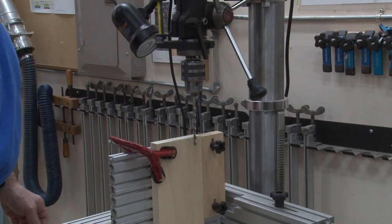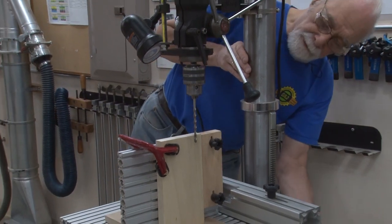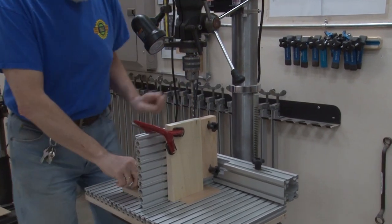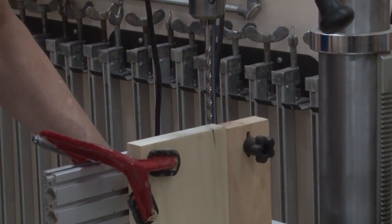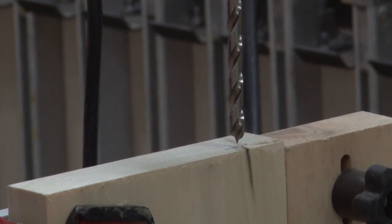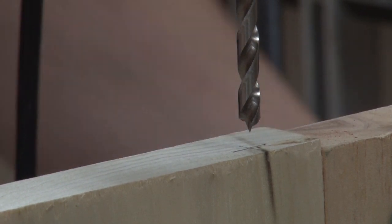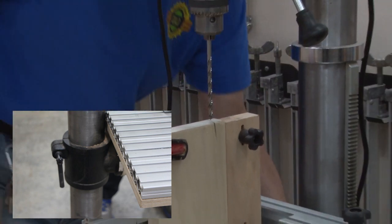What we're going to do is make the necessary adjustments. We're going to lower the table slightly to make sure that the drill bit clears the top of the wood, and we're going to start aligning ourselves. You'll have to release the jig slightly and get yourself into alignment — just lower this and you can see whether the brad point is right on your crosshairs that you already drew. Snug it up. Make sure to snug up the table as well; if you do not, it's very easy to move this table.